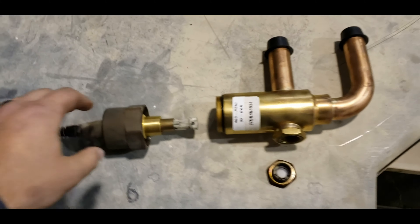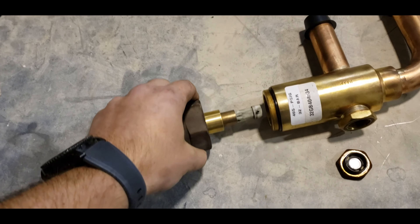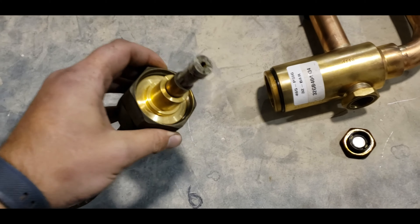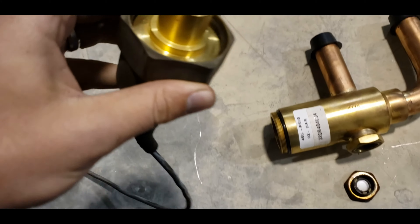You can see it's just that brass goes straight to the O-ring — there's not a whole lot to it. These should not be excessively tight, especially with that O-ring in there; it's not necessary. That O-ring sits down in that groove and you can see it's got a flare type shape to it. What I do on one this large is I get my pipe wrenches and just get one on the top, one on the bottom. It doesn't take an excessive amount of pressure — it should not be that tight. If it is, somebody did not do it correctly or there's something else wrong.